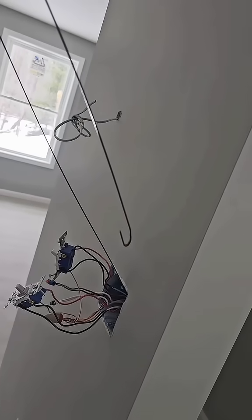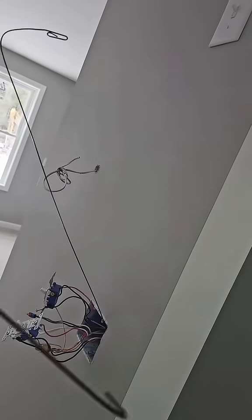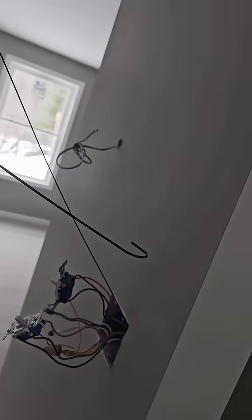You see the blue right there? That blue right there is the box. And can you see that black line? That's the snake we're going to hook and pull out. So I sent the hook down in that direction, but after I saw what I saw in the hole, I flipped the snake 180 degrees. Now the hook is going in that direction — I feel like that's going to be easier to catch.